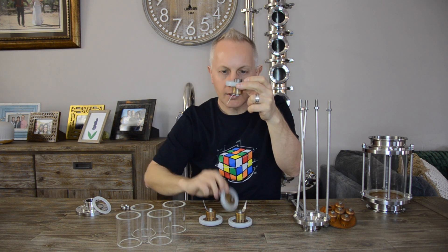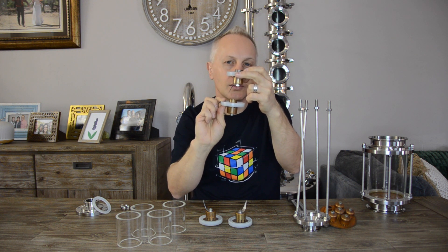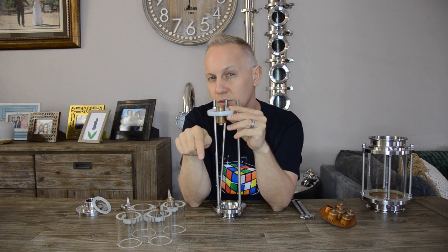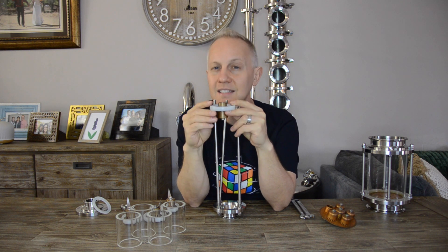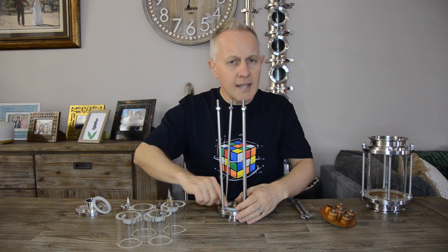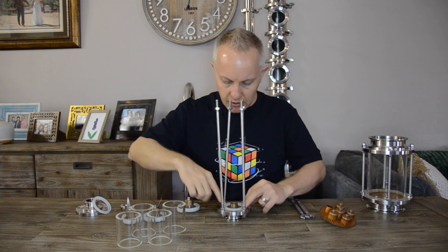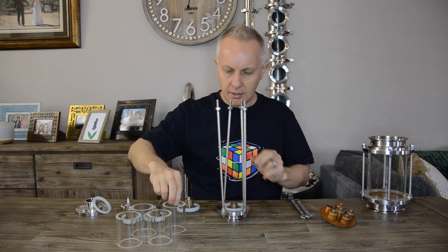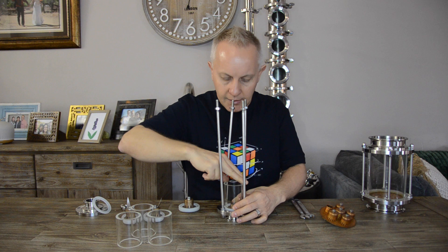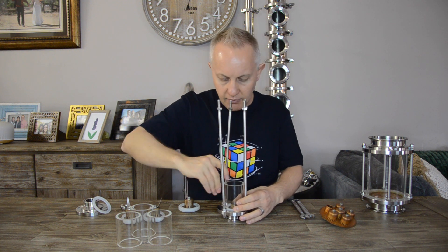Having this small section on here will direct the liquid falling onto the side of the perforated plate, to let it accumulate and do its job. First up, we start with the downcomer that does not have the downcomer drain direction piece, as this is the bottom tray — it doesn't matter that the liquid will fall straight down back into the boiler. Same as the 4-inch, I input it, making sure the downcomer is facing downwards, there's no overlapping, and everything is straight. For the glass section, I make sure it just slips in — then I know it's right — and I feel that there's no overlapping.